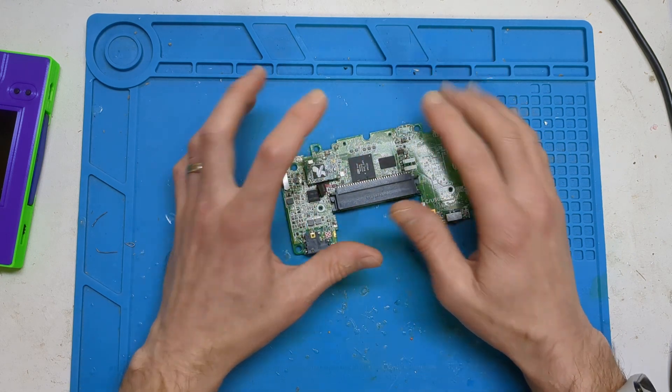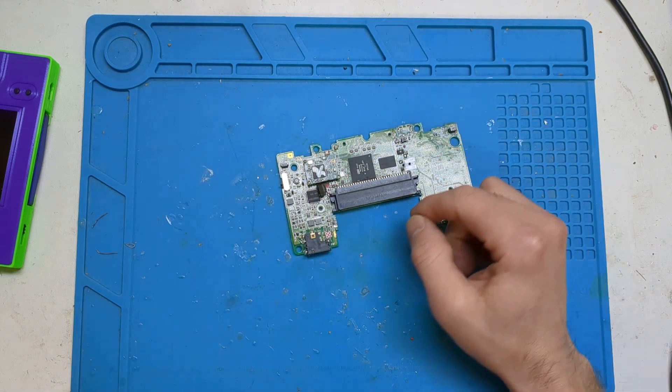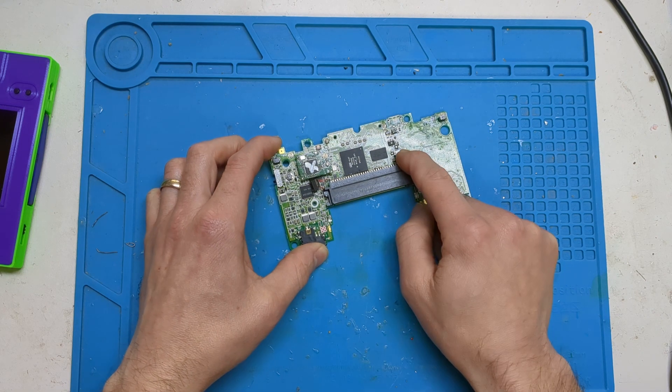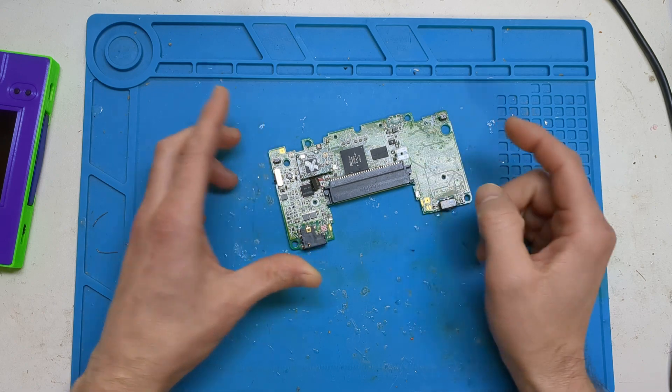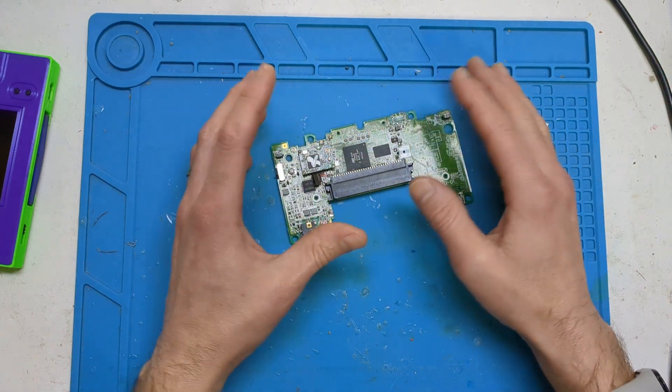So I had a look and found out you'd have to remove the DS cart slot to move the GBA port 40mm up into the PCB. I also didn't notice that the DS crystal was in the way, and also the battery post was in the way.